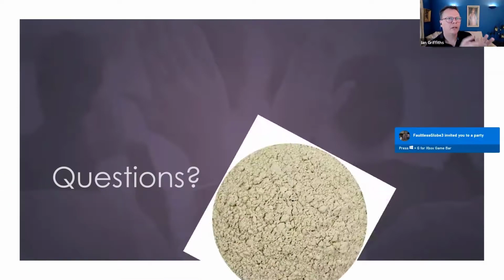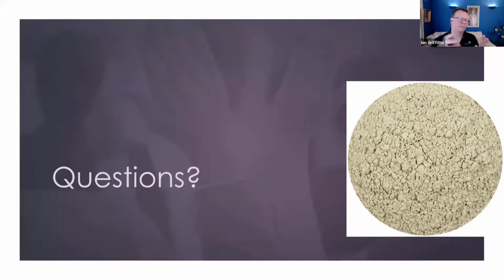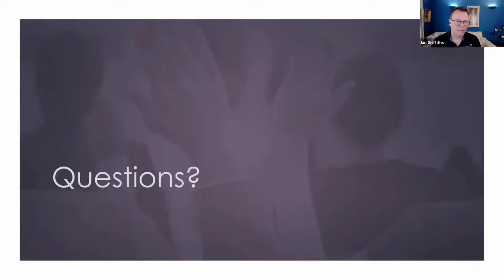Enhancement materials: finely granulated bentonite. Bentonite is a form of clay. It comes in large volumes from Cyprus. There are other places, and it absorbs moisture very well. When it turns into a slurry and a clay kind of consistency, that fineness of granularity helps the interface connection that we talked about earlier, because of the fineness of the particles surrounding the electrode.